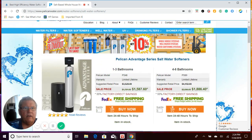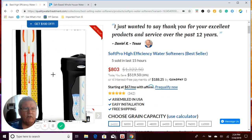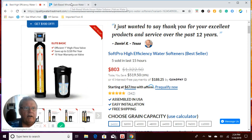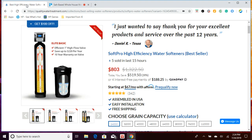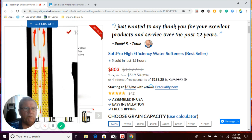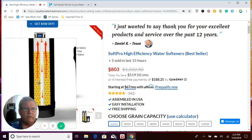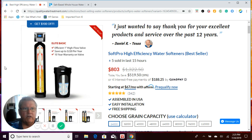The tank has a 12-year warranty on the Pelican system. The Soft Pro Elite Basic has a manufactured lifetime warranty on both tanks — the mineral tank and the brine tank. The Pelican system is a downflow system, so the water runs downward through the resin bed, whereas the Soft Pro Elite Basic is an upflow system, so the water runs down through the tube and upward through the resin. The advantage to that is it's going to lift that bed up every single time so you don't have any channeling, giving you 100% contact with the bed, which results in better performance.